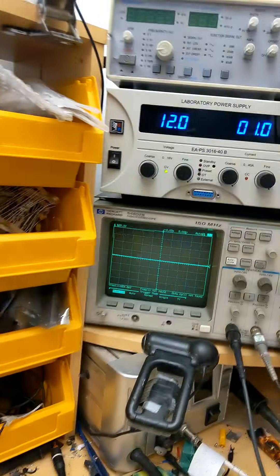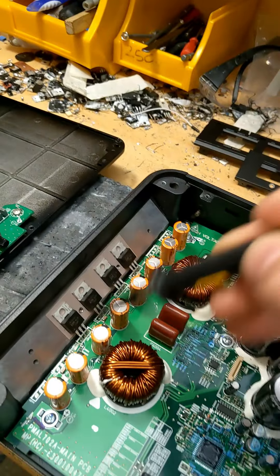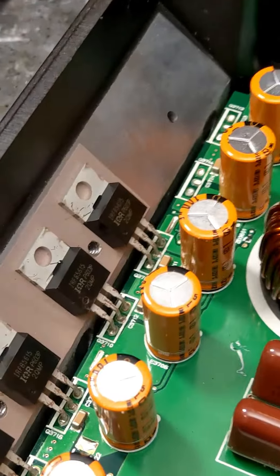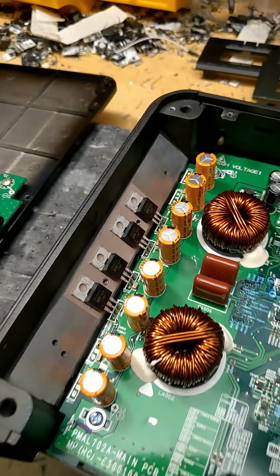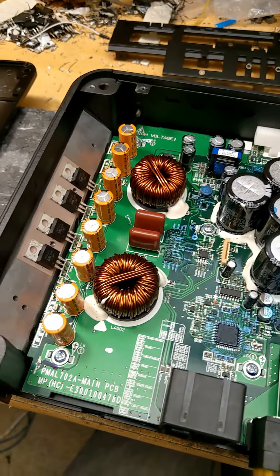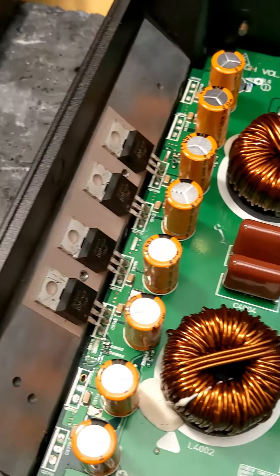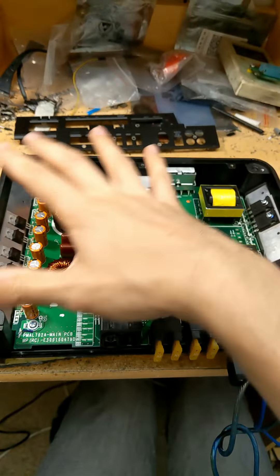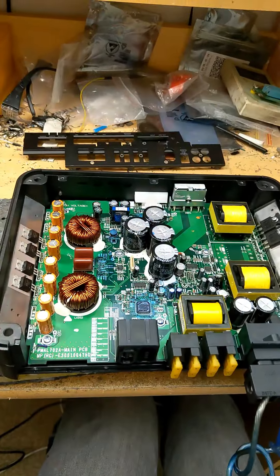Class D switching at 354 kilohertz - nice and high for a subwoofer mono amplifier. Now let's check the other low side drain - nothing there. So basically only one channel is working. Given that this is a full bridge amplifier, it's not going to work properly. We need to dig into the drive circuit for this channel. We know it's not a supply voltage issue because if it were, neither channel would be working - so I suspect a drive fault on this bank.